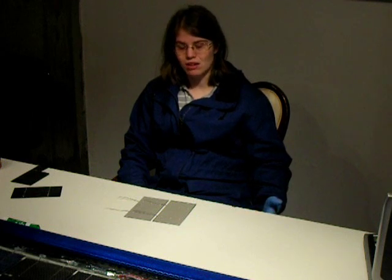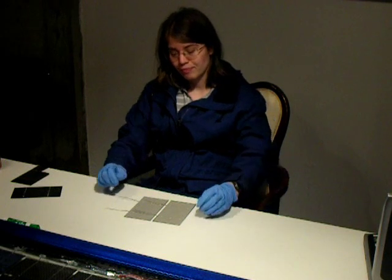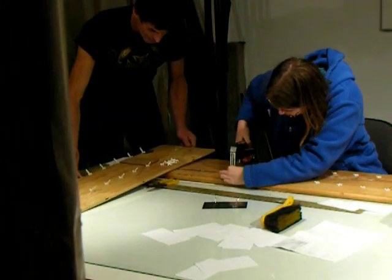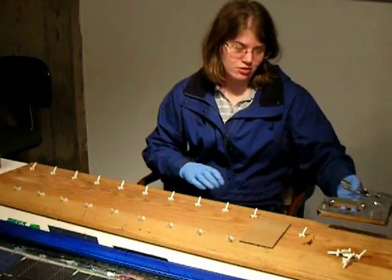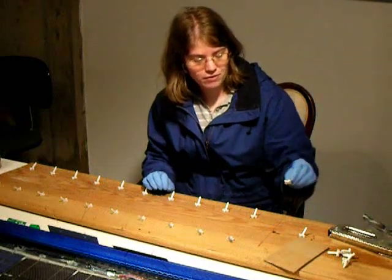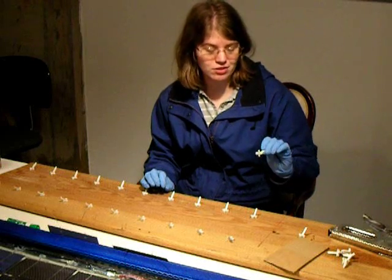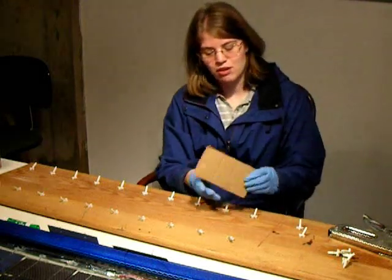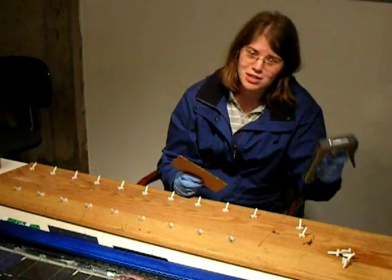In order to get adequate spacing of the solar cells so you'll be able to fit them on the glass panel later, you need to make a jig. This is the wooden jig we used to properly line up the solar panels. It's simply a piece of wood with cells spaced using quarter-inch tile spacers made of rubber, which you can find at any hardware store. We've also made a cardboard template for each of the solar cells — you do not want to use the actual solar cells with a stapler.